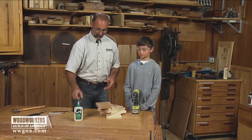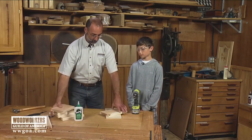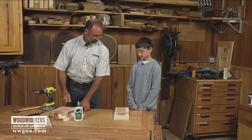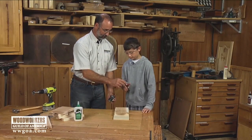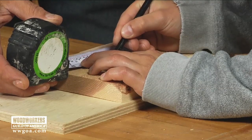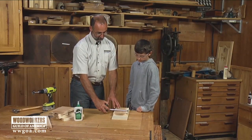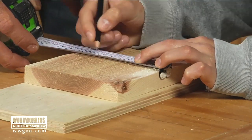All right, so that's enough talk. Let's get this woodworking part done. One of the 9-inch pieces is the front here, Georgie. So first thing to do is make a mark 6 inches up from the bottom. And then we want to divide this whole thing in half that way, so make a mark at 2 1/4 inches or so up on top by your other one.